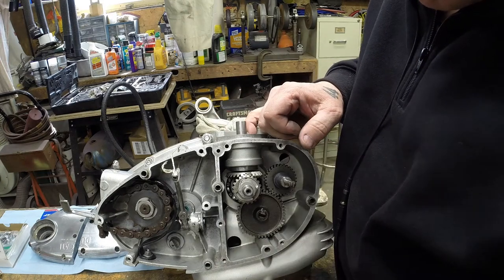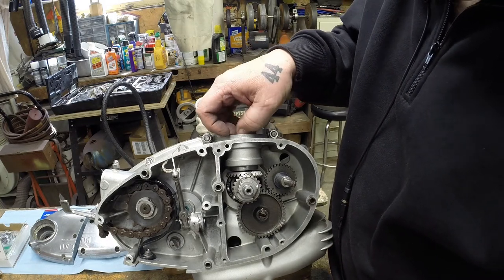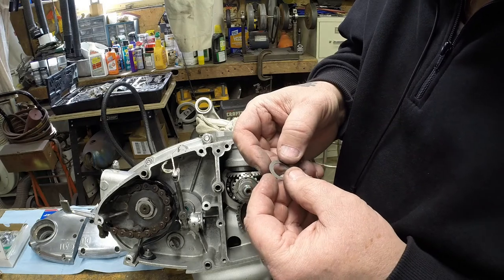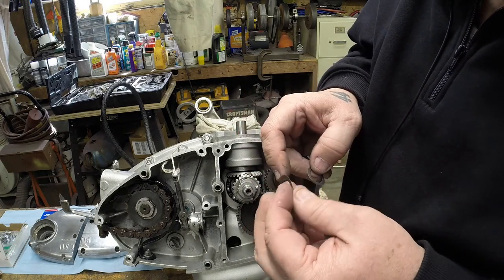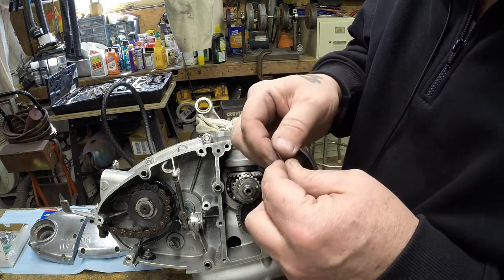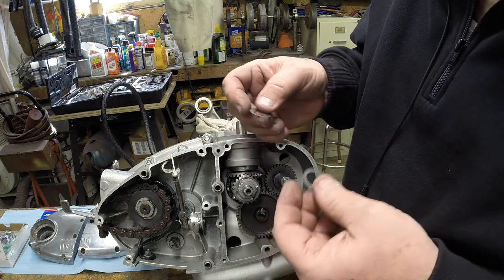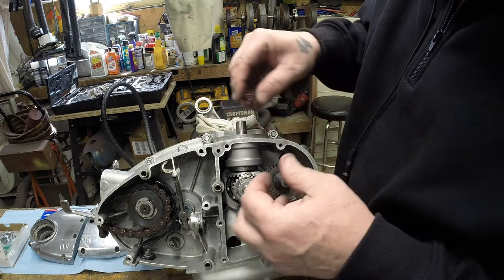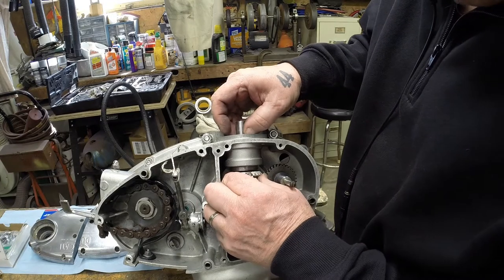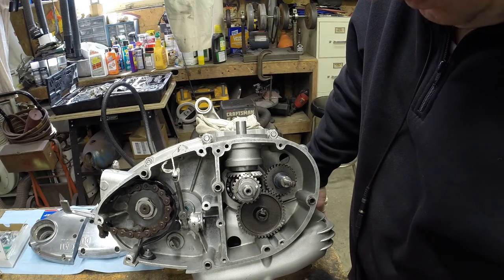Another thing that I wanted to mention now that I think of it is when I bought these shims, you get a package of them. And I know that these washers are stamped out and they end up with a rounded side and a sharp side. And what I did is I laid them on some 1000 emery and rubbed them to take the burr off, because if this is a 4 thou thick shim, the burr was actually about 3 thou, so it acted odd when I was trying to get things stacked upright. Humorously, a friend of mine said, well, that's what the oil filter's for, is to catch that, but we know better. So make sure you deburr your shims before you put them on.